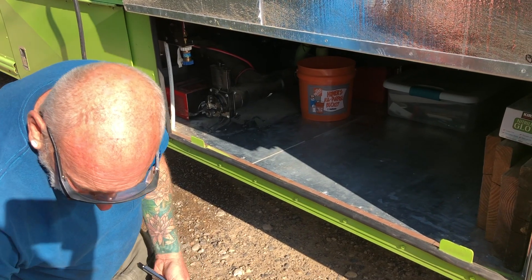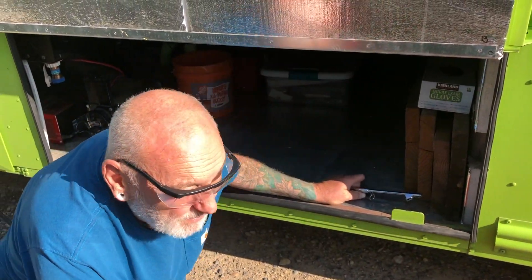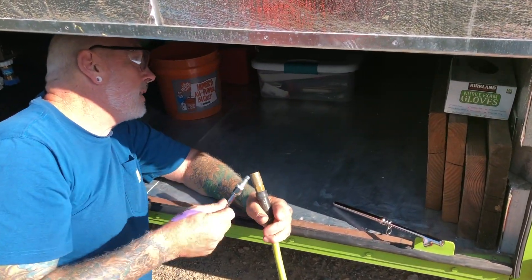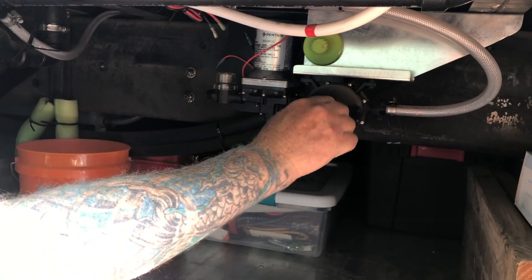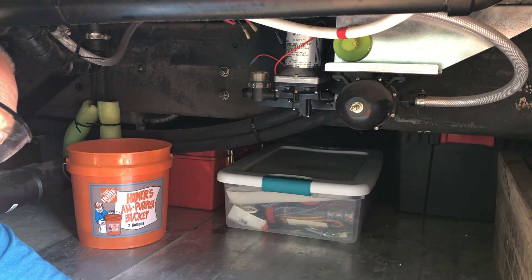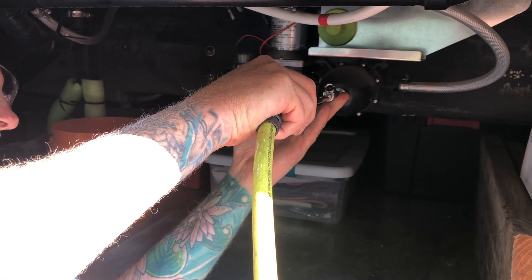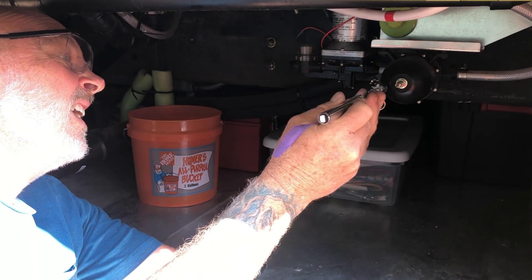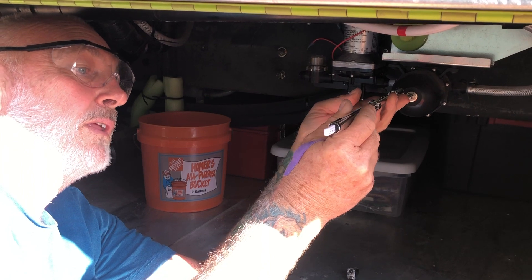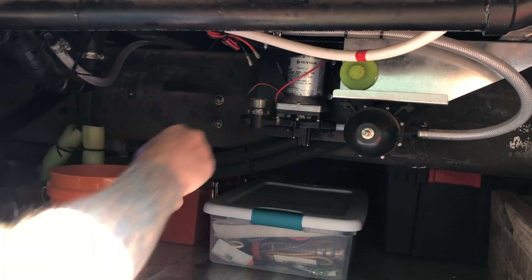When these things happen late in the evening, I checked the fuse in the fuse box — the fuse was good. I came down and tapped on it — that didn't work. Then I thought maybe the accumulator tank was out of whack and keeping the switch from working, so I depressurized the accumulator tank. That's recharged now and I've got the pump remounted.